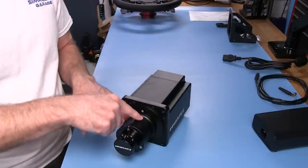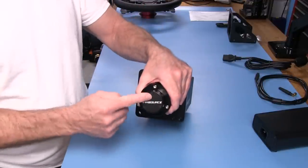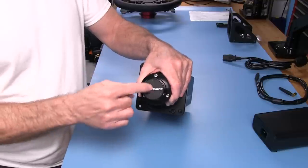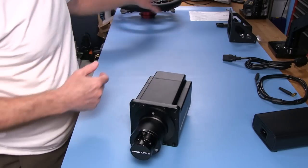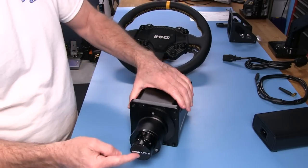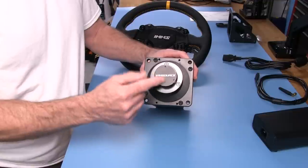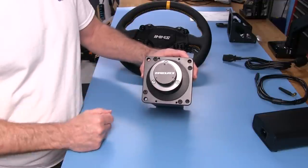And then they have some wires coming out that will attach to a plate that's up here that does have some traces or pads where some pins will land, and these pins are in the other side of the hub, like over here in this wheel. The pins would be in here, spring-loaded, and they would press up against those pads, and the power can be transmitted. Pretty simple. This is different.